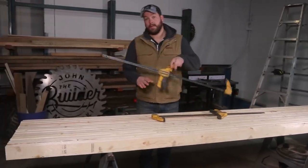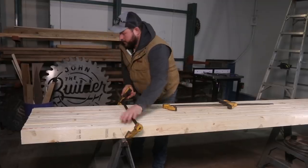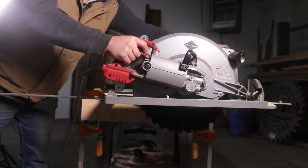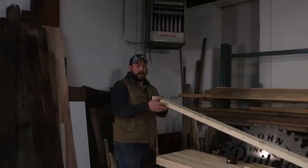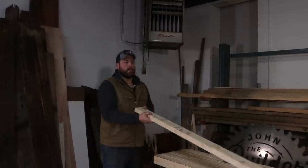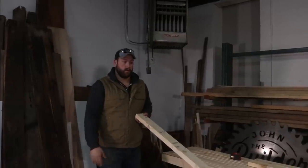Because I have 14 of the same size to cut and I don't have a miter station with a stop block, we're going to batch-cut these on the circular saw. I'm going to line up one end, clamp them all together, and then we're getting out the beam saw. One thing you want to make sure you remember when doing any framing is that the crown on all of your verticals all goes in the same direction. It makes sheeting and whatever you're going to put over the walls much easier. We're going to check the crown — this one doesn't have any, but I'll make a note to keep them all facing out so they all bow in one direction.